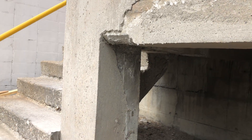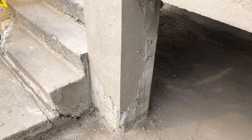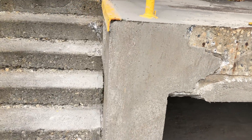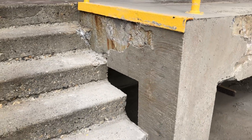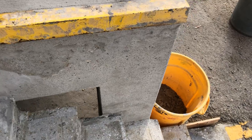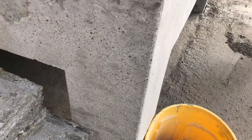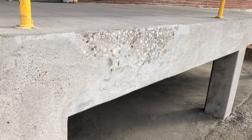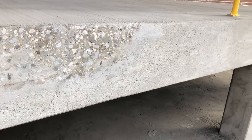We're re-encapsulating the rebar, getting that nicely protected so that the rusting process stops occurring. We also tied in some new bar into those upper holes that you initially saw, just to make sure the structure was back to its original intended design.